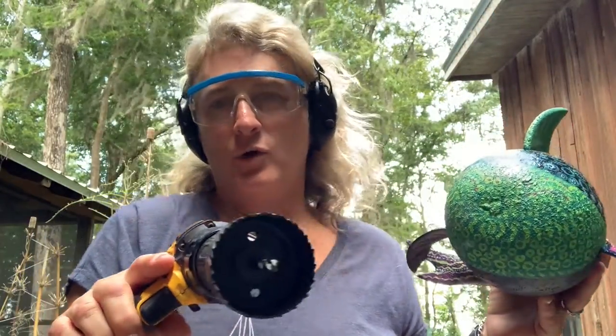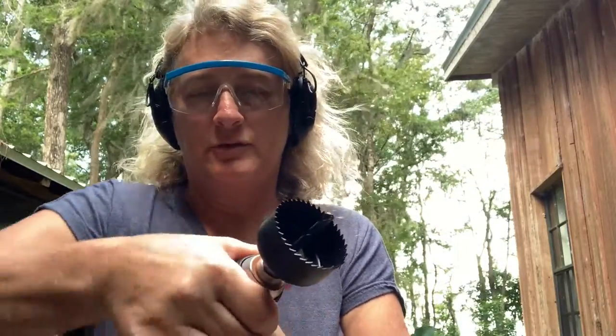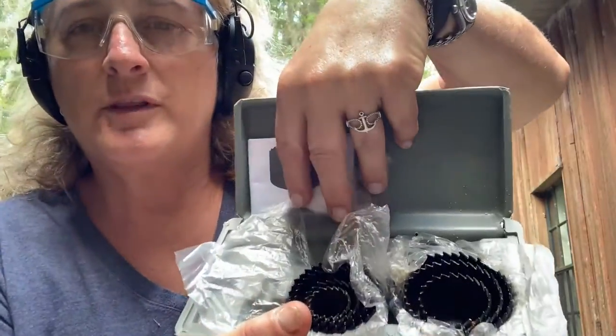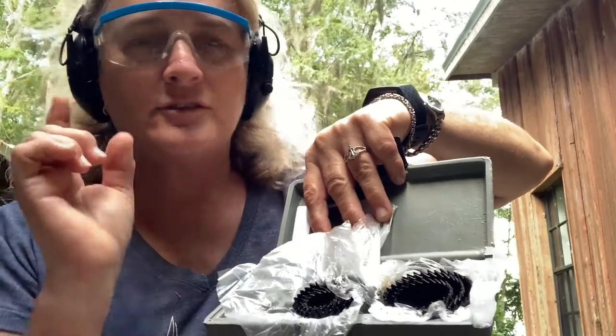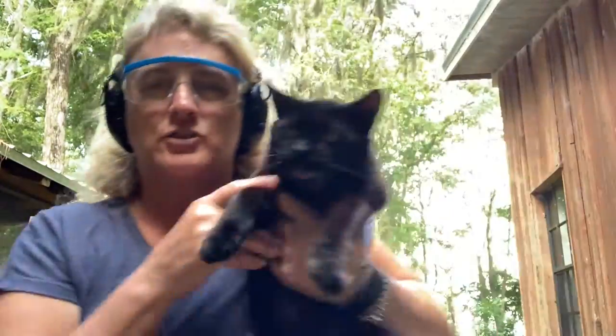It's time to cut the hole, so here goes. I've brought out the drill and I have a hole saw on it. What this is is a drill bit where you change the size of the saw — the part in the middle comes apart and you have a set of different circles that go with it. It came in a box like this, not all that expensive. This is how I get exact holes — I just use one of these hole saws. It has a drill that starts the hole and then the teeth finish it, and then I'll sand it so it's a little less ragged. Jasper wants to come say hello — he's here watching.